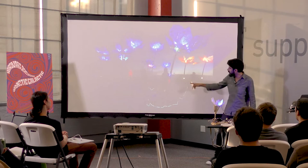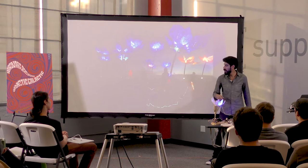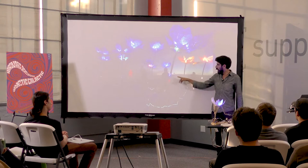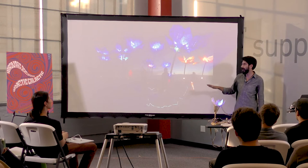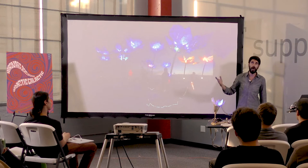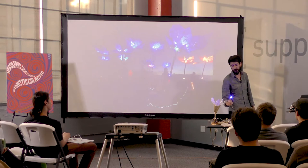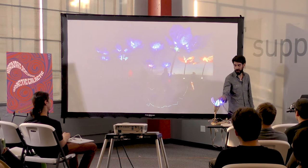These get installed — you can see a red light inside that shows you where to put your hand. It's a hamsa hand covered in orange EL wire, so it's lit up. You'll notice these normal-looking 20-milliamp LEDs you can get off the shelf in LED strips — fairly inexpensive, five-meter strips. But these other lights are much, much brighter: three-watt LEDs. This is only one channel so it's only using one watt right now. There's a heat sink on the back. We had nine of these high-current LEDs per flower.